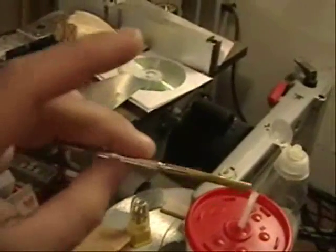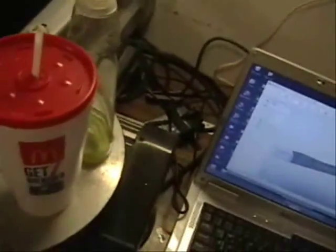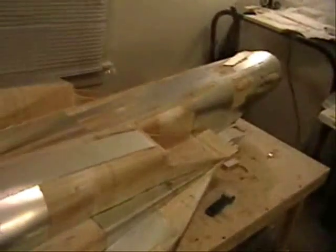For things like our rivets and screws and little access details, we just took screwdrivers and brass tubes and kind of shaped them how we needed. We've got one here with a Phillips head screwdriver. And then for those Calfax fasteners, we just took an Allen wrench and stuck it in a brass tube — you can see it just barely sticks out above it. That way it'll actually put more of the Allen portion of the fastener into the aluminum than the brass tube, so it shows up a little bit better that way. But that's pretty much where we're at — just slowly working away getting this thing knocked out. We'll see y'all next time in the shop.